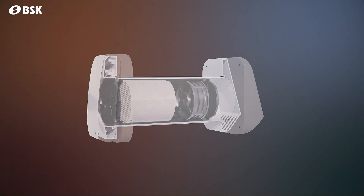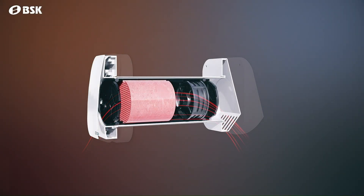In the exhaust phase, air is drawn from inside for 70 seconds, transferring heat to the ceramic core. In the supply phase, fresh air is blown for 70 seconds, warmed or cooled by the ceramic core based on the season.